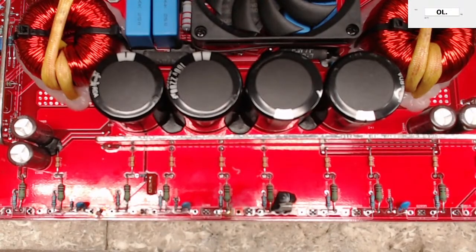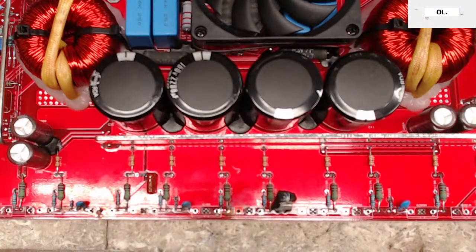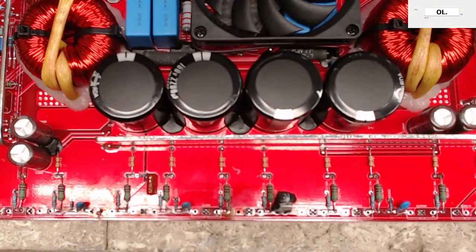Oh, and hey guys, you remember yesterday that Maxonics board that I was working on that wasn't getting drive, even though I changed out the drive card? Guess what it was? It was the TVS diode on the low side rail. Another TVS transient voltage surge suppressor diode failure. Actually, it wasn't failed, it was leaking, so it was allowing some negative rail to pass, which was dragging down the input signal to the card, which was keeping the 072 from creating its square wave. So, yeah. Fun facts there.